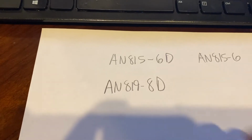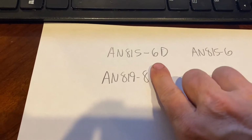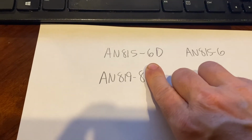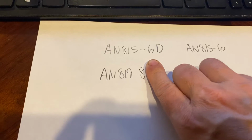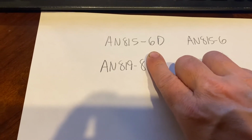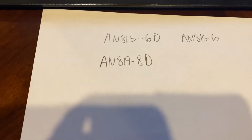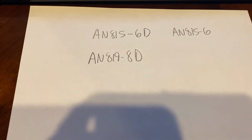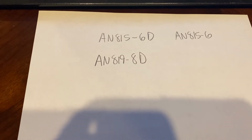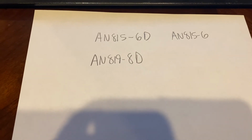And then the D would tell us the composition code is aluminum alloy. If I just took that D away, it would be the exact same part, but it would now be black in color because the steel fittings are black, and it would still be an identical size, identical look. It would just be black in color. Okay. So I just wanted to go really quickly over how to size fittings, because there's going to be some questions about that on both the unit exam and the tests and quizzes and things like that. So I just wanted to make sure I covered that.